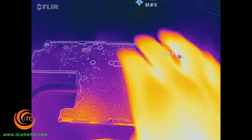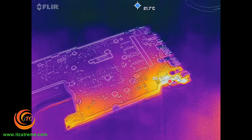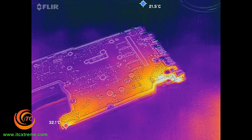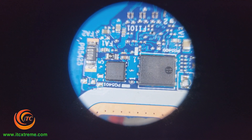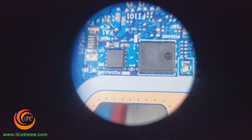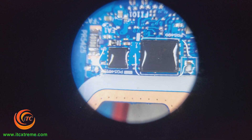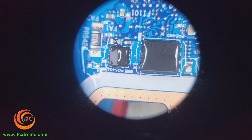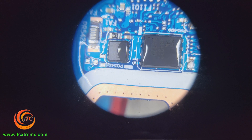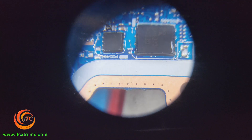What I'm going to do is the alcohol test under microscope now to try and establish which is the problem — the primary side of the 19 volt from the DC power supply. We're going to spray a bit of alcohol onto these two components and see what happens as soon as I turn the bench power supply on. There's a hot spot on that — we can see that MOSFET is getting cooked, but that may not be the reason why we have alcohol evaporating.